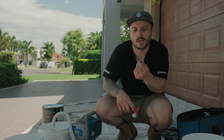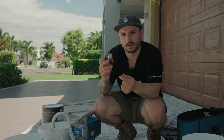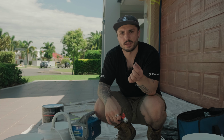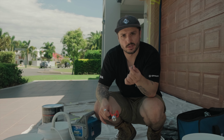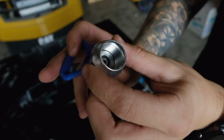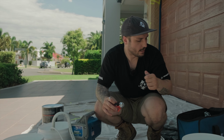So we definitely recommend just picking up a couple of extra tips when you get your unit. It also comes with a spare one seal. It's the little seal in the bottom of the packet. If you're switching between, you know, blue and green tips or something like that, these need to be changed because they are smaller for the fine finish tips. However, going from a true airless tip to a true airless tip, we don't need to change it, so this is a great backup. If you're not sure how to install this or what that looks like, we have a great video on it, so you can check that out. Link's in the description, or it's above here, wherever Jacob puts it, so check that out.